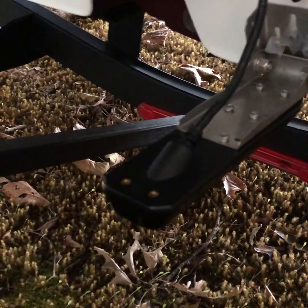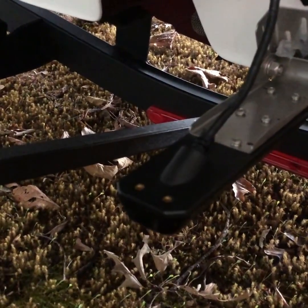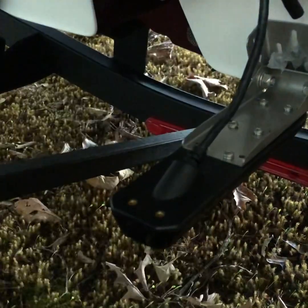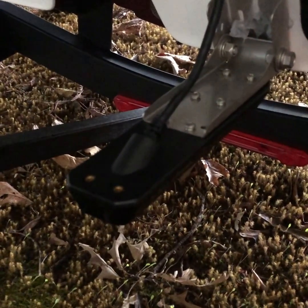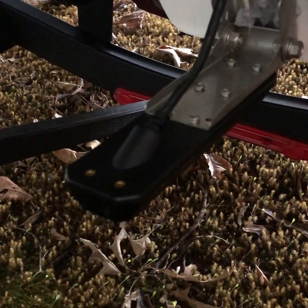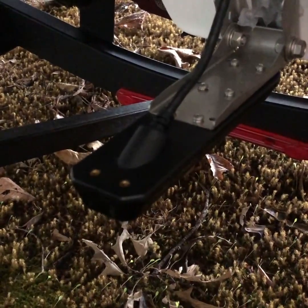Okay, if you fish with somebody, scrap all of that except for the level. So like I said, put your level on the front of your boat. Adjust it with quarters however high it needs to be to make it level, and then after you do that, come back, jack up the front of your boat until the level's level with the quarters, and then you can level out your transducer and install it.